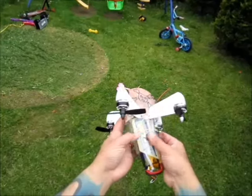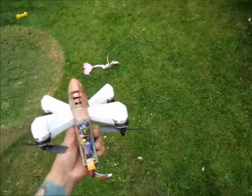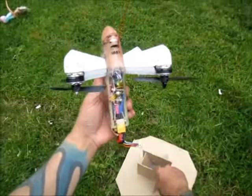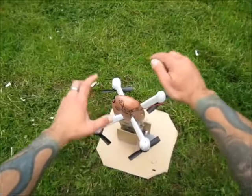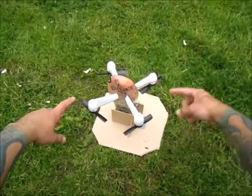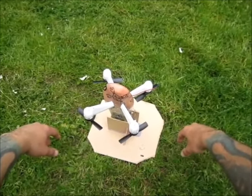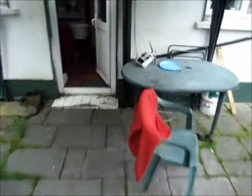So I just wrapped it in clear PET that's 0.3 millimeters in thickness. Now I checked in my arms and it looks like the PIDs, of course, are too high, so I reduced the P on pitch and roll to 3.2, and I reduced the yaw to 7.0-ish. That's a starting point. And let's give it a go before maiden.